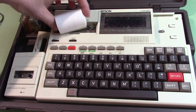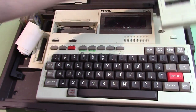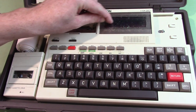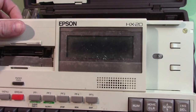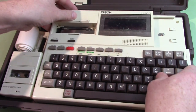It has a little thermal printer over here, an LCD screen, and a little cassette drive that goes over here. The batteries in it are dead. I did get it to cut on for a couple of seconds but there's a big black block on the screen that's not working. So I ordered some NICAD batteries, sub-C size, and we'll have to build a battery pack.